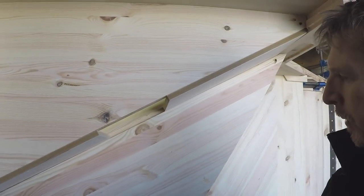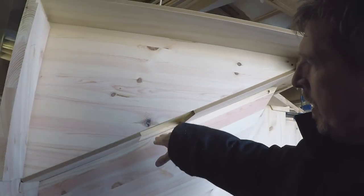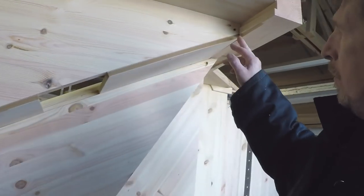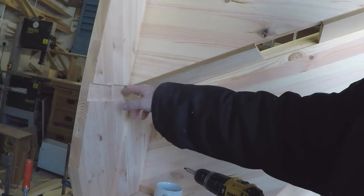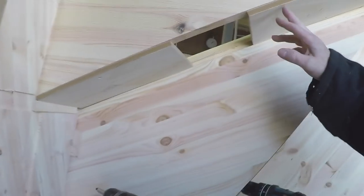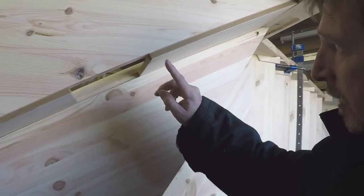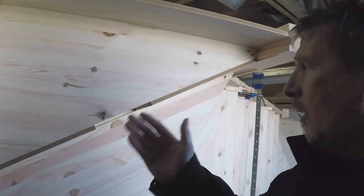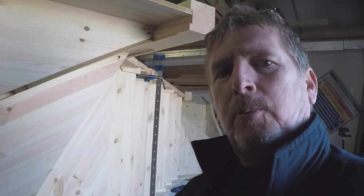Here's another wee tip - I'm doing my risers now. I've got to get a riser fitted in from the back end of the groove in here. Instead of trying to measure it in one piece, cut one piece, and then try and fit it in, I'll take a wee piece and fit it in there, angle it back slightly so that it goes right to the point. Same up here, into there. Then I'll just measure the distance between here and here, write it on here, take the two pieces over to the saw, cut and copy the angles - because they're slightly angled top and bottom - and Bob's your uncle.